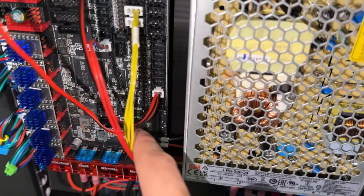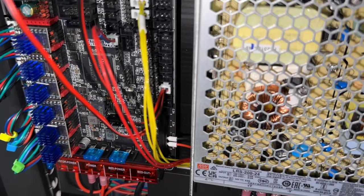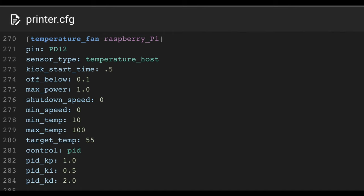The initial PETG tune is complete, so I started printing pieces that are outside the hot chamber. My priority was installing controller fans. At 100% speed, the Pi temperature is 42 Celsius, a 10 degree reduction versus no fans. However, it is noisy, so I modified the config to adjust speed based on temps.